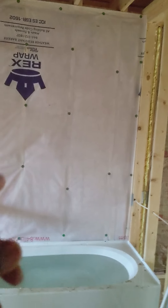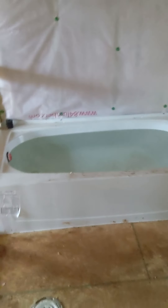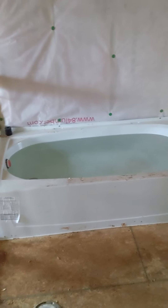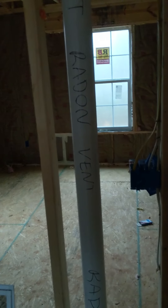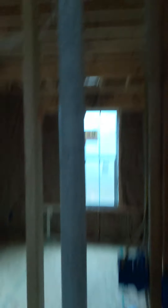For the bathroom, you have to pre-insulate the area behind your tub. When you do your plumbing inspection, they want to see that your pipes are holding water, so you fill up all your pipes which in turn fills up your tub. They want to make sure your tub is already pre-insulated. You also have to put a vapor barrier — some type of waterproof material. And depending on the year of the house and your local laws, you have to have your radon stack with 'radon vent' written all over it.